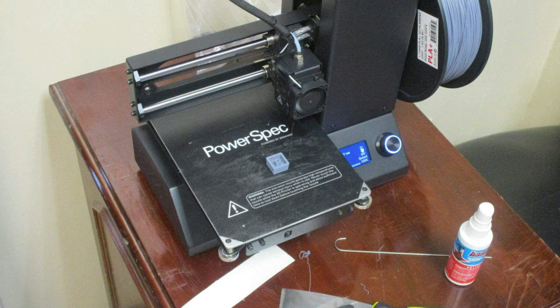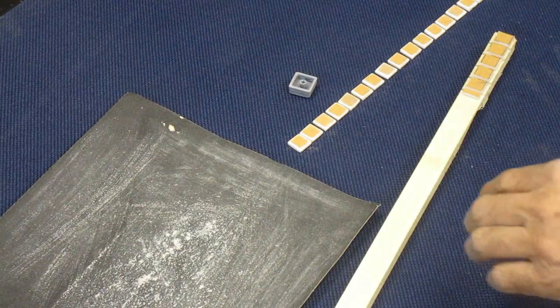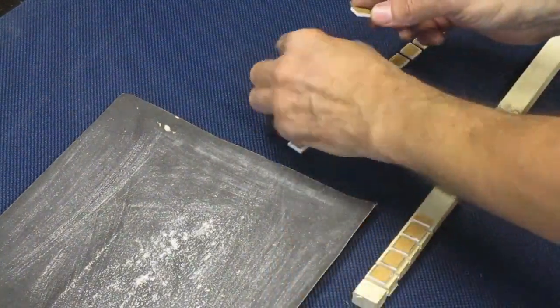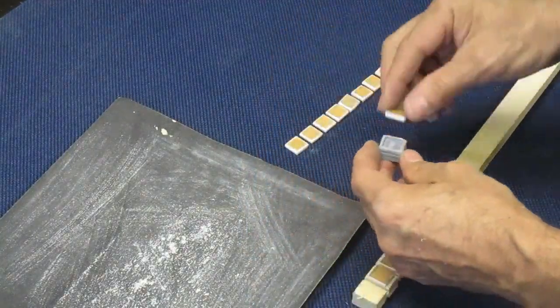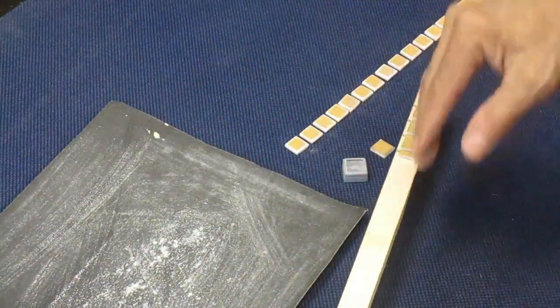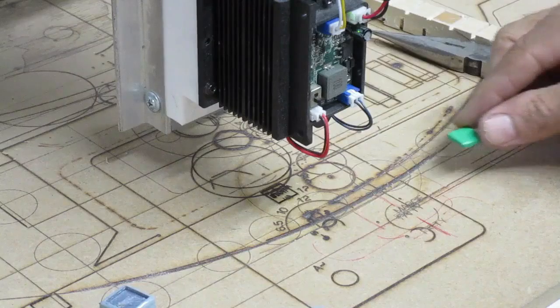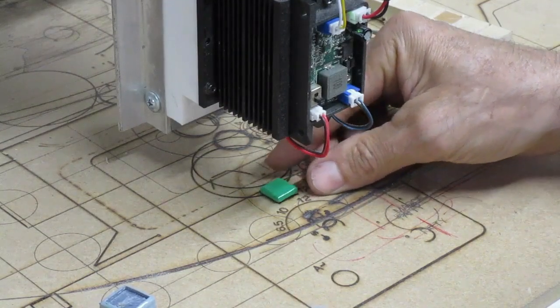After all that, I proceeded to 3D print the keycaps. Meanwhile, I cut some 1/8 of an inch wide acrylic with the sharp saw. Then I painted the acrylic according to function and group. And then, using the laser engraver, I etched the names on all of them.